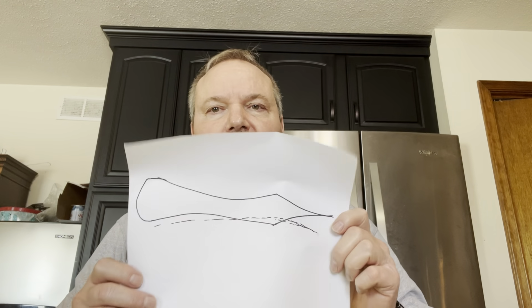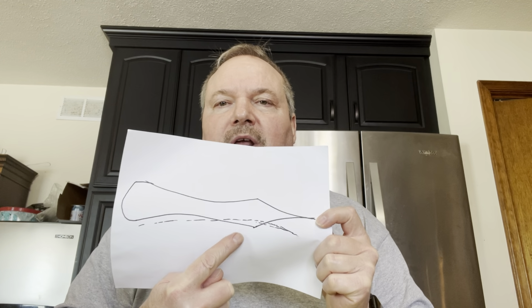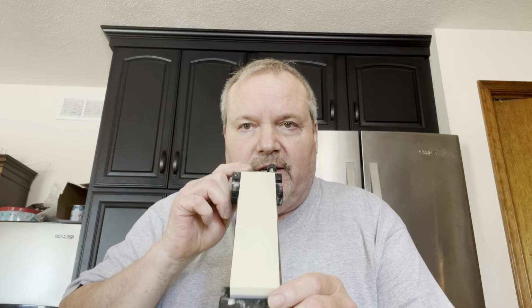And it was very surprising to me that the Boker razor was, I was already on a given curvature, but the Boker razor had already had some of this type of thing. So when I came along with my stone, okay, I was hitting right on the edge, which showed me that what they were probably doing was using a shorter radius for their work than this particular one.